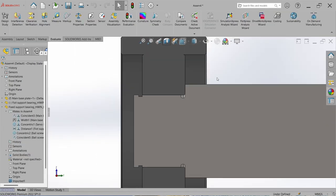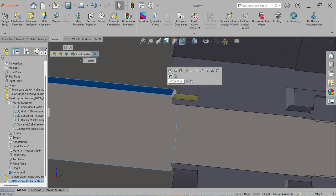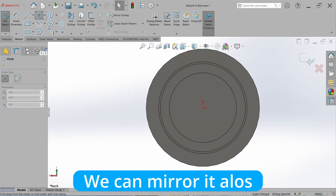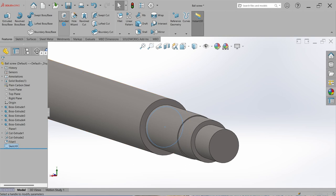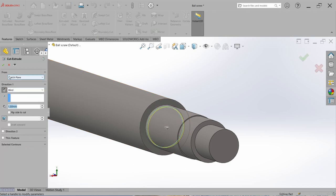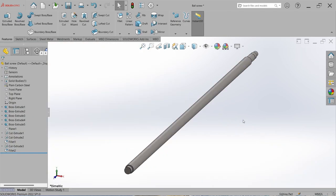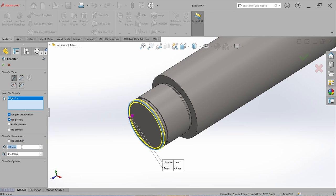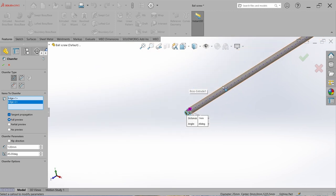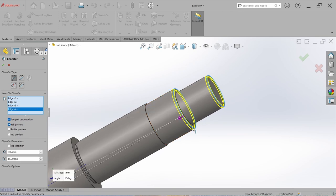Back in the assembly — this is perfectly fine. We should also add an undercut at the fixed side bearing block. Open the ball screw again, go to Sketch on this face, draw a circle of 23 mm from origin, go to Extrude Cut, change the direction, set it to 1.5 mm, check Flip Side to Cut, and hit OK. Add a fillet. Now add chamfers: select the chamfer tool and apply 1 mm chamfers to the relevant edges. Chamfers make the parts easier to insert and also make it easier to assemble the threaded nut.